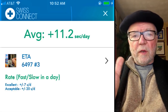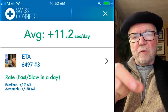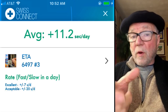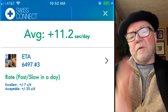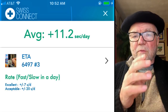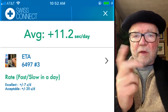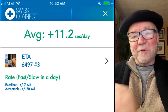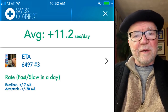The reason I like doing it before I put the movement into the case is there are these little plastic cases, and you can put those in the time grapher just as well as a regular watch case. Then you take off the top, move the regulator a little, put it back on again, and do another time grapher reading until you get it just right. If you're very lucky you can get it on the first try, because there's a little pointer you move to make it faster or slower. So that's the first thing we're going to do, and then I'll put the whole watch together.